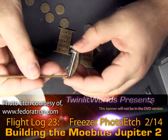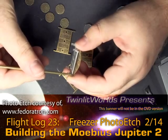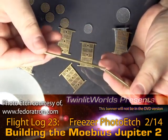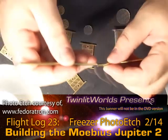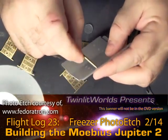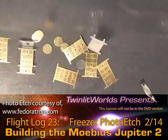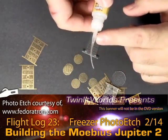The step on it is going to be one-and-a-half sixteenths — so the step is one-sixteenth and the plug itself is two-sixteenths. This brass tube is exactly the length you need it to be. I don't know that I could cut a one-sixteenth stepper like that, but I do have brass tube that this would slide into. It's a little tight — looks like it might be a micron thicker. That's certainly a tight fit, so I'm just going to skip this and glue these straight on.